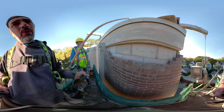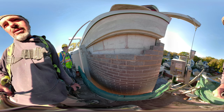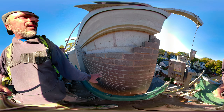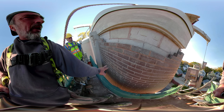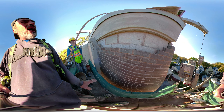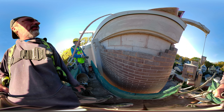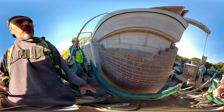Up here the color of the mortar totally differs from the lower section — we haven't seen it drying up yet, but this is more gray; the color has come out of the wall. We're going to do a cleaner on it and see how the color matches afterwards, because that will take out some of the color and make it more uniform with the rest of it.